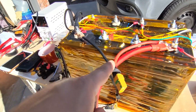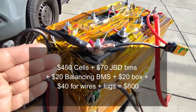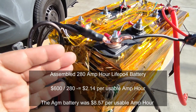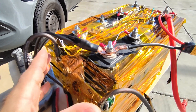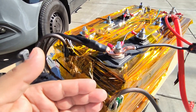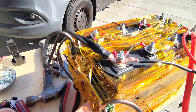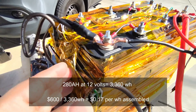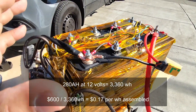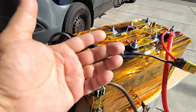I'll show you where to get the cables and everything — with the box, $600 total. Breaking that down: we're paying roughly $2.14 per amp hour, which is a really great deal. In watt hours, 280 amp hours equals 3,360 watt hours, so we're paying $0.17 per watt hour for this battery bank assembled. I calculated about $40 in cables and miscellaneous parts, so everything is accounted for.